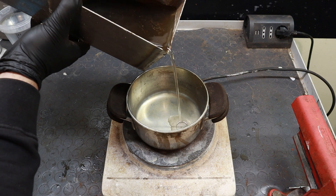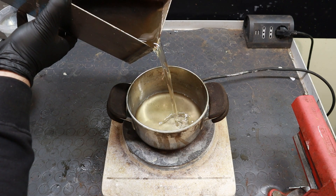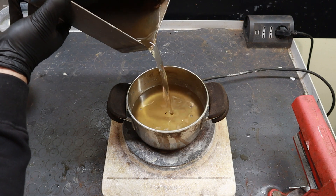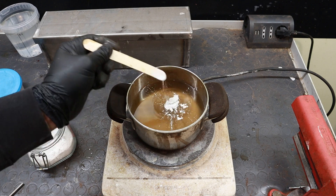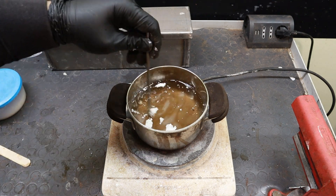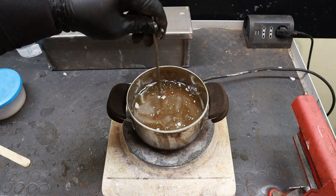Don't ever try to handle the hot solution. If you want to store it in a jug, wait for the liquid to cool down, and only use jugs made out of polypropylene — most other plastics are dissolved by the solution. Every time you reuse it, remember to add a pinch of slaked lime and one of potassium nitrate, since the oxidizer can get depleted as well. One thing you should avoid is dipping parts that are still heavily rusted, since that rust will partially dissolve in the bath and cause problems later on. Also, you don't get a nice bluing if the part is still rusty when you dip it.